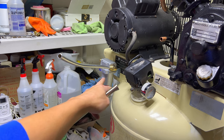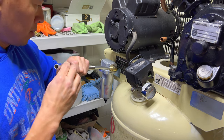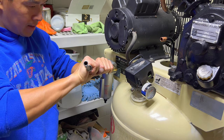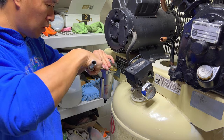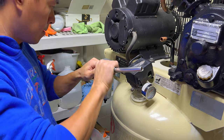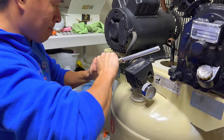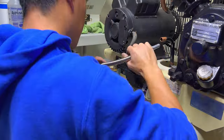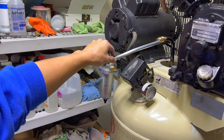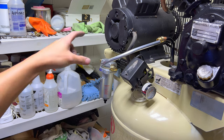Now I've mocked it up into the water separator and I'm going to bend it slowly using the spring bender. Start at the bottom with your radius and slowly bend and turn it by hand, sliding the spring out as you go so it doesn't get stuck. You want to make a really sharp bend coming out of here and then straighten it toward the fitting. I've got everything mocked up pretty much where it needs to be, so I'm going to put in the compression fittings, tighten them down, and get this set up before continuing the rest of the install.